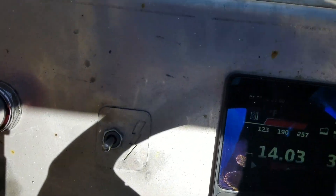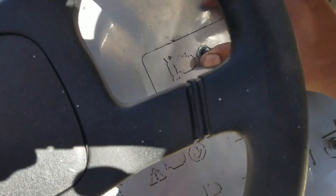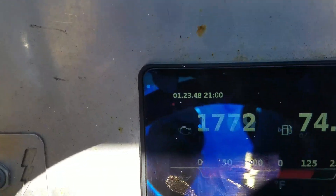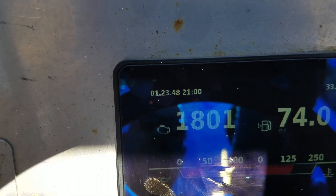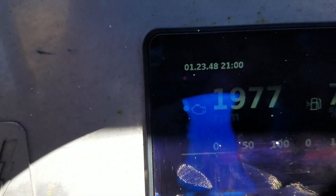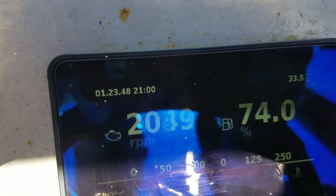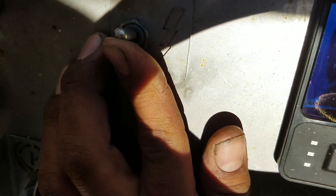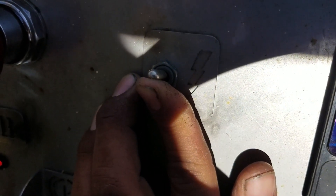If we go back to RPMs, you have your throttle switch right here. When you bump it, it goes up 200 RPMs every bump — you can see on the screen that every bump goes up 200 RPMs. When you want to operate the generator, your RPMs should be at least 2000, that way you're able to turn on the generator because it won't function if it's slower than that. You have your switch for your generator to turn it on or turn it off.